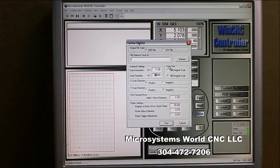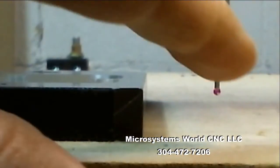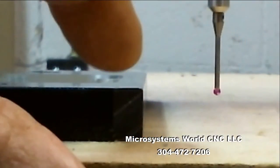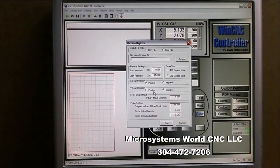The scan size — I always do 360 degrees. This was adapted from a surfboard scanning software, so I leave the 180-degree option in case those guys want to use it since they only scan half their surfboard. For me I always do 360. I have the choice of starting in an X positive or X negative direction — X positive goes one way, X negative the other. That's only the start direction because this walks all the way around parts.